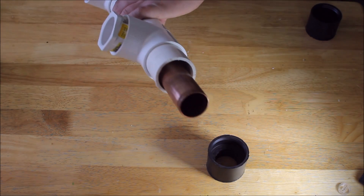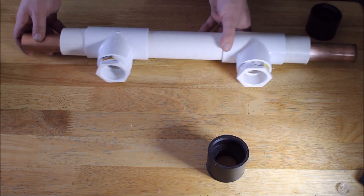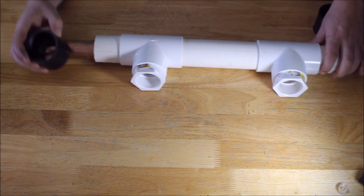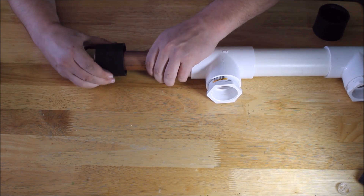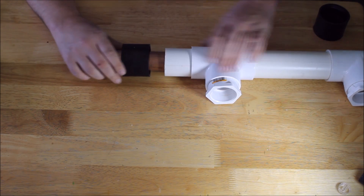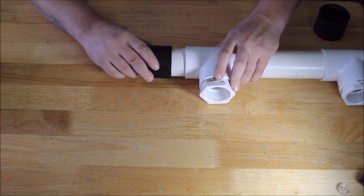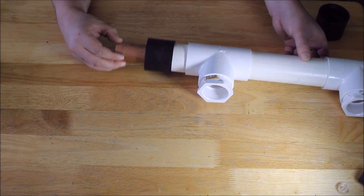I have been asked a lot of times, why do I not make heat exchangers out of pure plastic? Plastic is an insulator and it actually does not conduct very well, which means that the two liquids trying to exchange temperature can't — they're actually being insulated from each other. Slide the MJ coupling on easily. You could even use a little bit of lubricant here if you're having a hard time sliding the MJ up the copper.